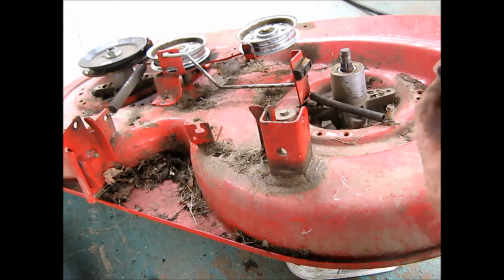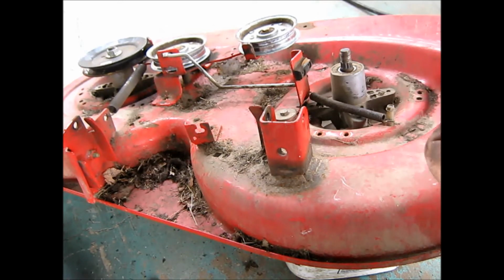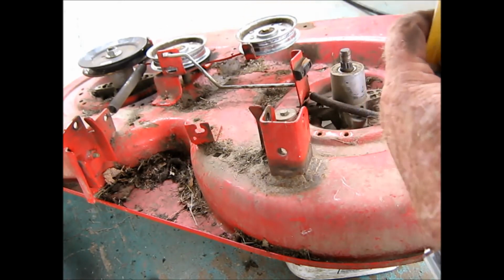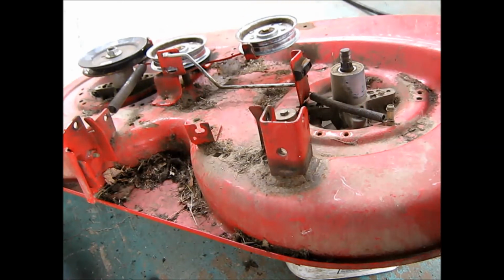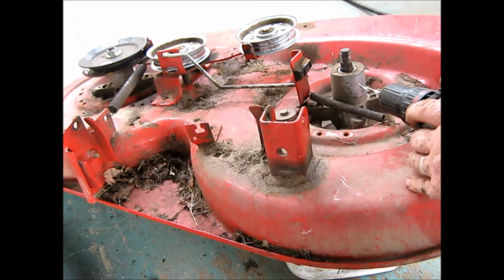See, these little grease fittings here are just the press-in kind. They don't have any threads in them, and they say here to use a... well, let me get one out here, and then before I dump the whole bunch. It says here to use a 3/16 drill bit. I don't know if you can see that or not. Probably not. But anyway, that's what we're supposed to use. So we shall proceed to drill a hole in here and see if we can install that little dude.